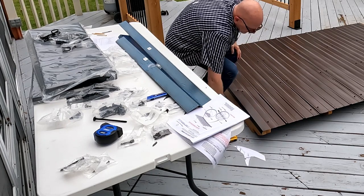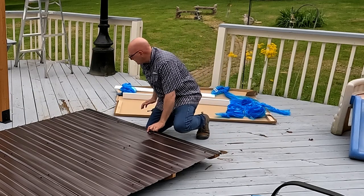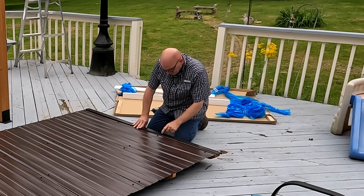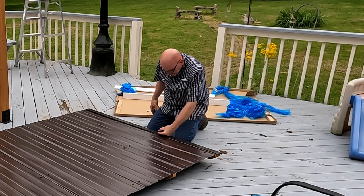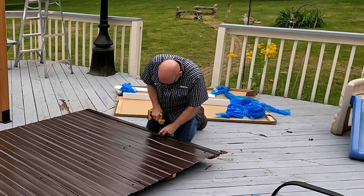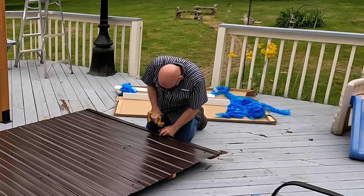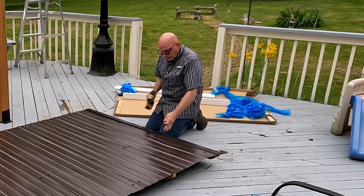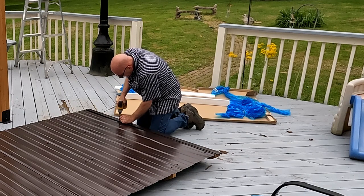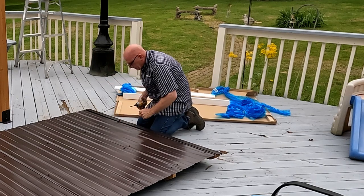Okay, the remaining screws for this would be put on with the other trim. I've got the other piece of side trim here. I'm going to line it up the same way as that side, flush on this end and overhanging more here. We're assuming that's going to work out. We drive the two screws toward the center. We are going to offset a little from our row of screws because we know there's a purlin screw underneath this ridge. We want to avoid it like that.